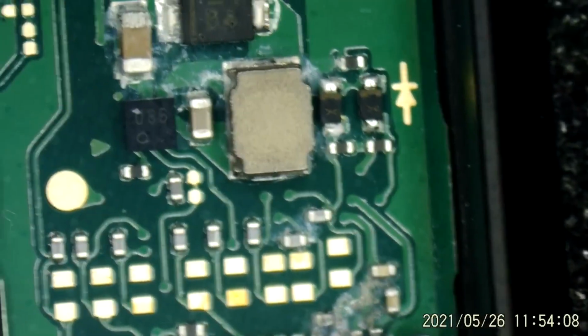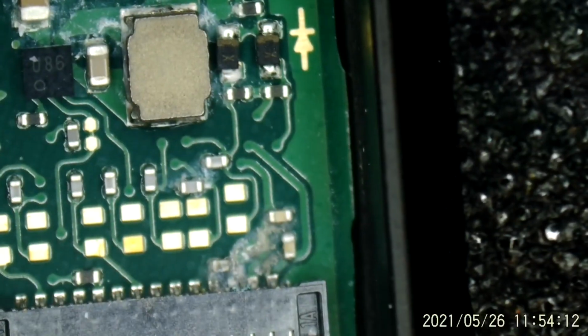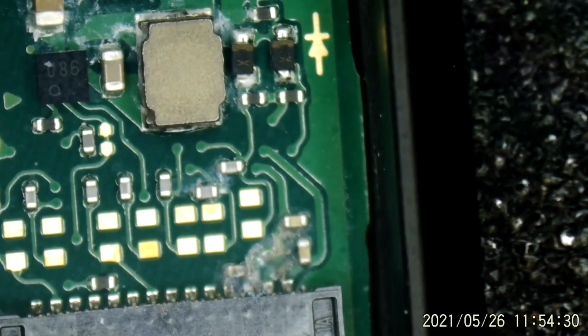So, that may have been the only issue. It may have shorted out the backlight so it wasn't really usable, and people put it aside, and eventually the battery just drained to the point where it wouldn't work anymore. Let me fire up the old meter. Let's just see what that battery voltage is while I'm looking here.